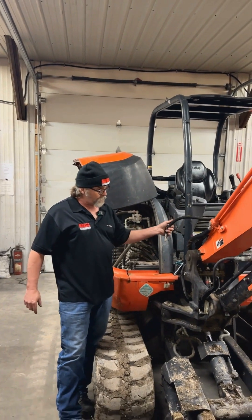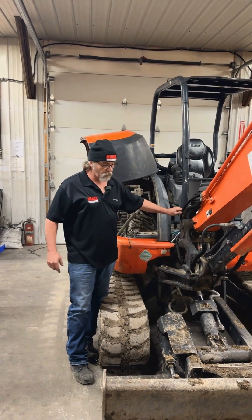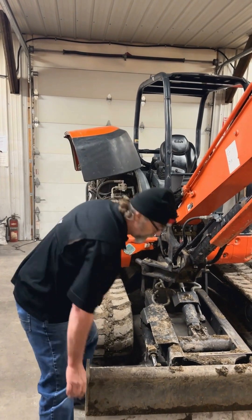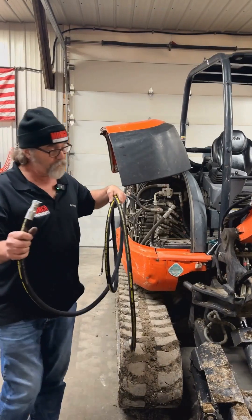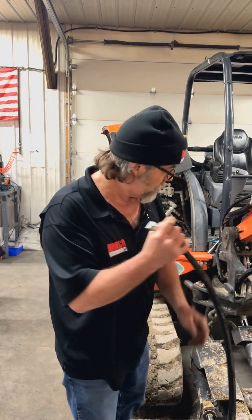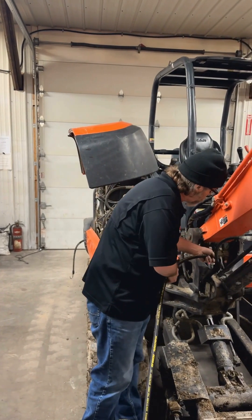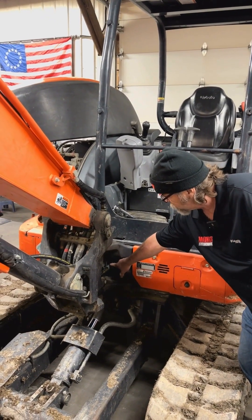It should work out that your union is back towards the knuckle. We're going to grab our long hose and work it through into the tank. When you're shoving this last hose through, you always want to try and keep the end of it capped off to keep any dirt from getting into your system — save your filters. You're going to go down through the knuckle; there's a port right here for an extra hose, and you're going to go through there.